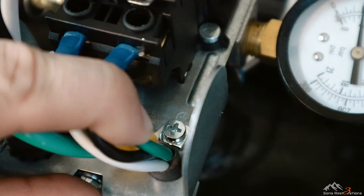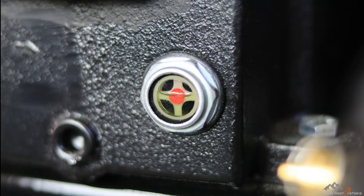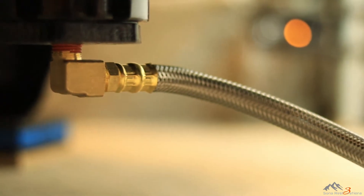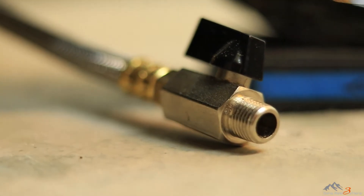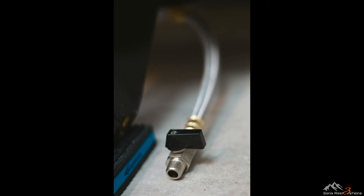The manufacturer leaves an empty screw for your ground wire. Next, after checking the oil level and running the compressor for 30 minutes to break it in, I took off the petcock that came installed and replaced it with an extended tank drain assembly, which allows for much easier access to draining water from the tank. I highly recommend one of these kits — it encourages performing the necessary draining schedule these compressors need.